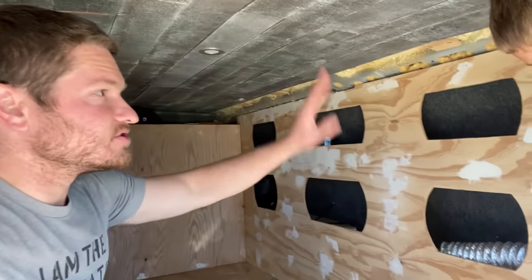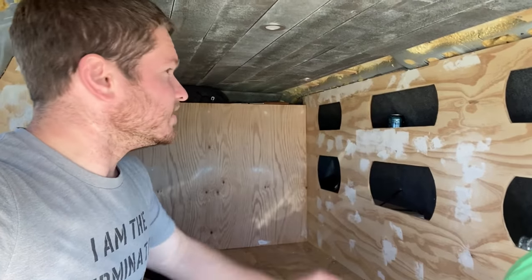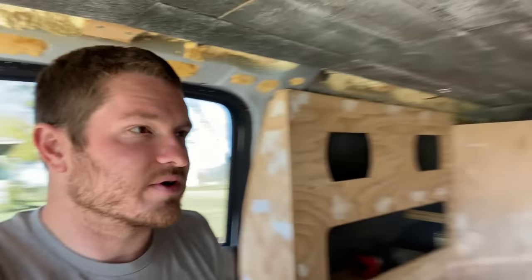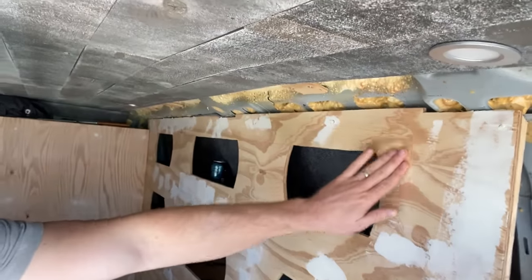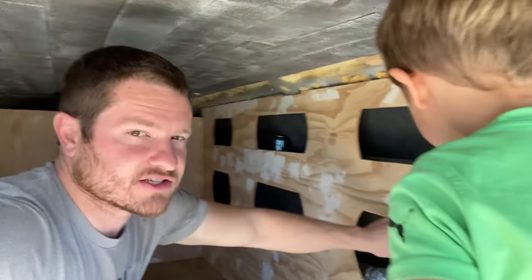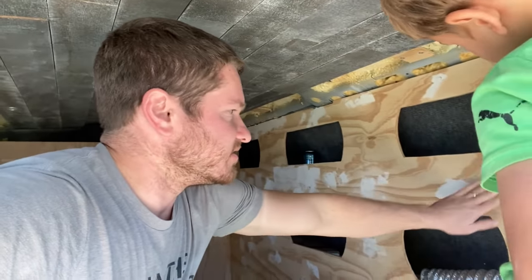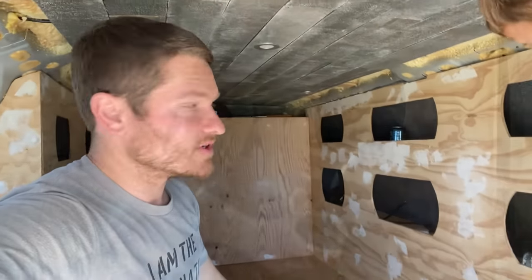This is all dry now, so we're gonna run through and sand it with the 220 grit sandpaper. Run through, sand that, sand all this one, and then see where we're at. I'm not sure yet if I need to try to fill more of the grain on this. There's definitely still a little bit of, plywood isn't that smooth. Haven't decided yet if I need to do that again, or not, but we're gonna sand this down, see what it's doing.